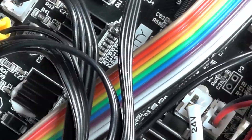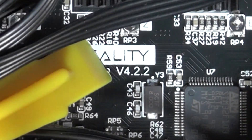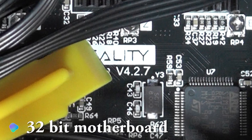Let's do a little bit of movie magic and spin the video right side up. Here you can see the version of motherboard you have. If you have version 1.1.2, 3, 4, or 5, it will mean you have an 8-bit motherboard — in that specific case, this tutorial is not for you. I've put a link in the description to a tutorial that will teach you how to do a firmware update on 8-bit motherboards.